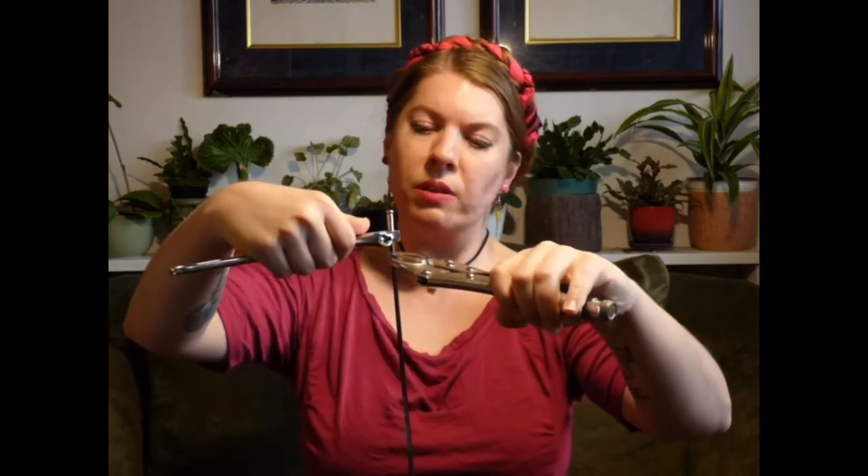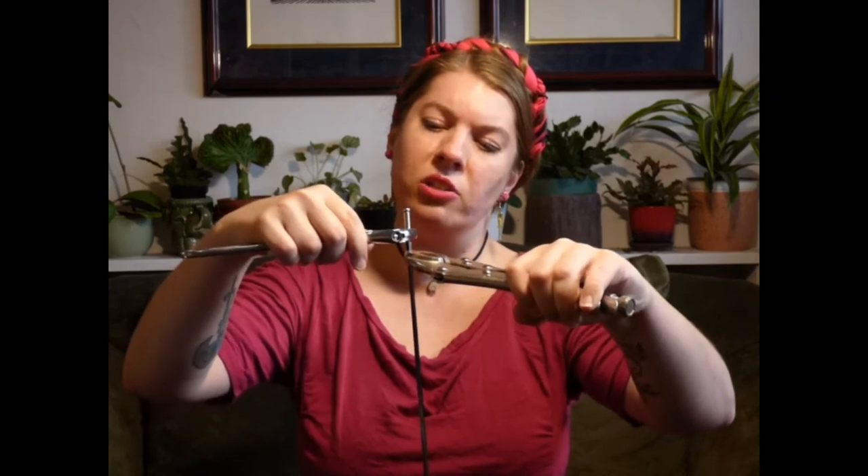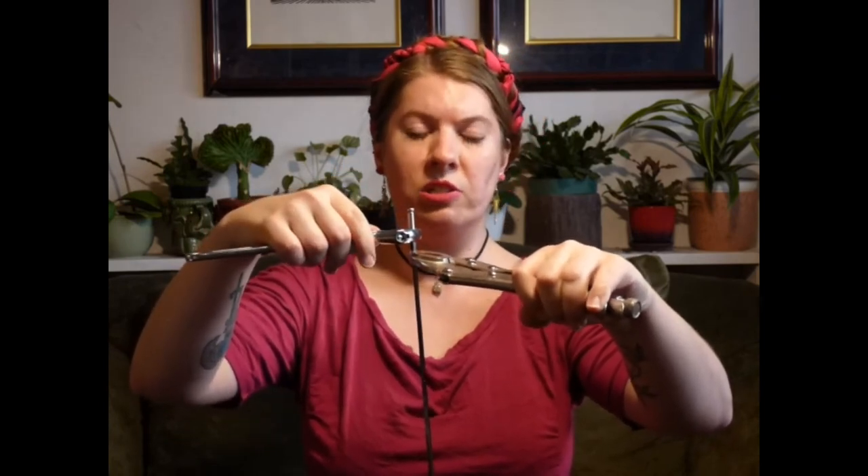The best way I can describe it is to continue at a slow and steady pace until even that relatively gentle pressure stops working. At that point it can be concluded that the barrel won't tighten any further without significantly greater pressure and a much greater chance of cracking the barrel. It's generally just a feel that you develop as you do this a few times.